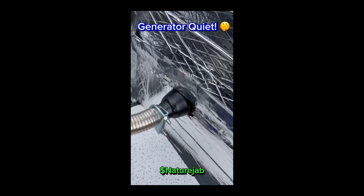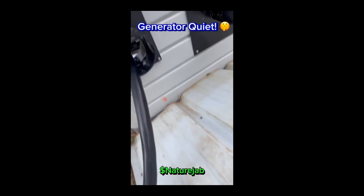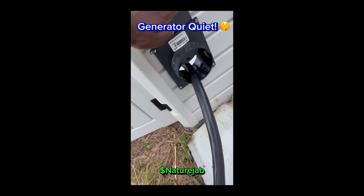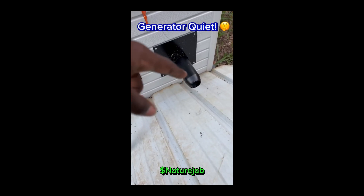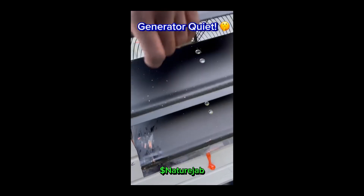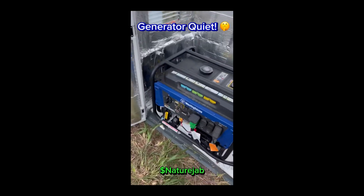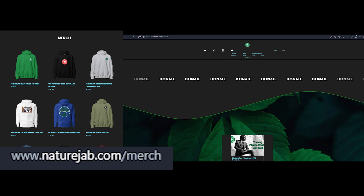The highest temperature you want internally, with good airflow, is about 120 to 140 degrees Fahrenheit. You don't want anything above that or you'll hurt your generator, and anything above that can damage plastic too — though 140 degrees won't melt plastic. With this material on top of everything, it also provides sound deadening to help absorb some of the sound. Those are all the materials — without further ado, let's get to the build.